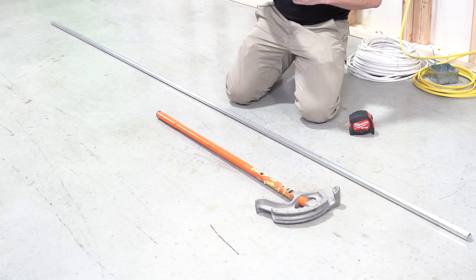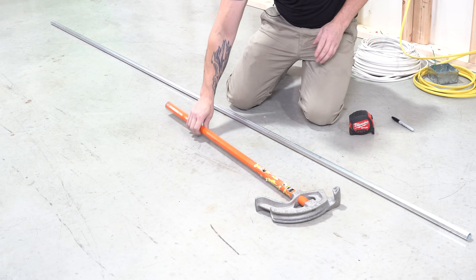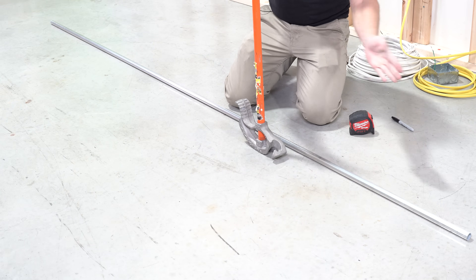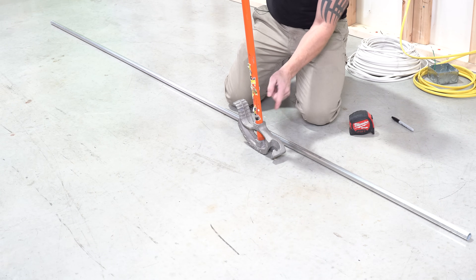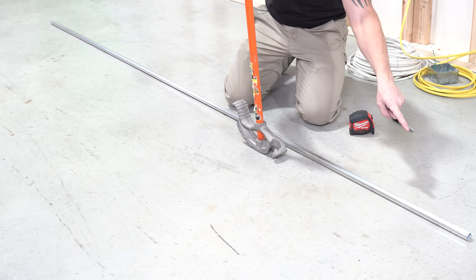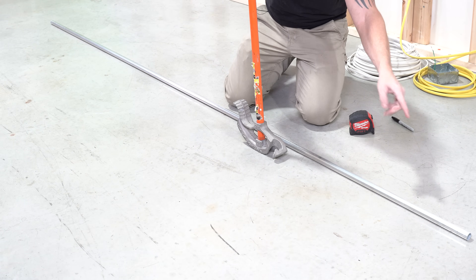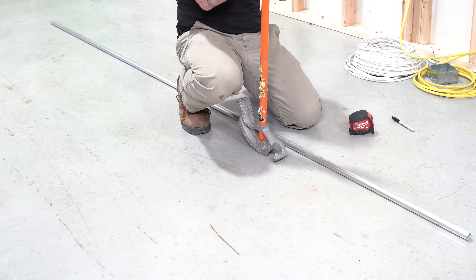When you're doing this whole takeoff method, I'm going to show you two different methods of bending 90s depending on which way your bender's facing. If you've just taken a measurement and you go back six inches, that means your bender needs to face the direction you just hooked your tape measure onto. So I hooked my tape measure there, so I'm going to bend facing where my tape measure just came from.